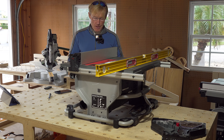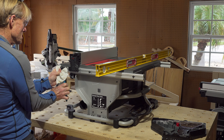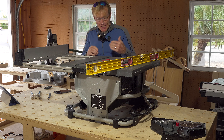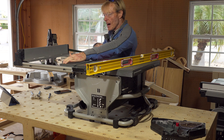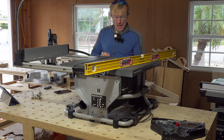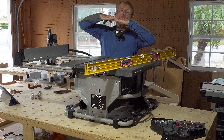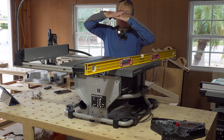You don't need to move it much. There is a 3mm Allen in there — you don't need to loosen or tighten that to do this. Put the fence back out in that same position and lock it, then flip the support back over. With just that small turn, I've dropped my support down one eighth of an inch, and the back is a little less than an eighth. Now I'm going to reverse the process — I want to raise it back up, which means going counterclockwise, just doing small turns. The back is now perfect, but I still need to bring the front up just a little bit more. Just by adjusting this back and front puck, you can align this material support perfectly.